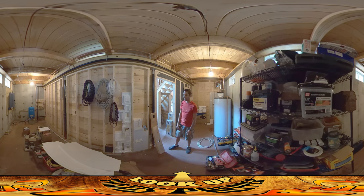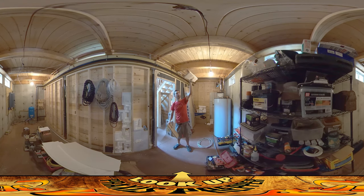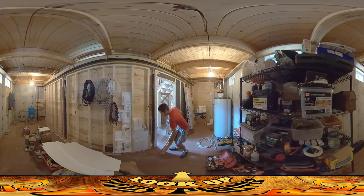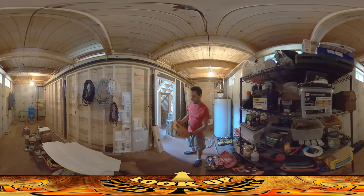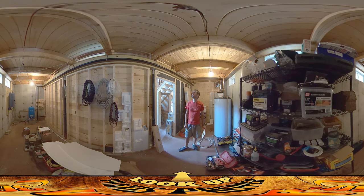I'm going to fill it up with all different bits of scrap, then buy one inch foam and fly it over the top, maybe put some thin quarter-inch plywood or luan over it to hold it all together and make it look nice. The thing I'm working on today are these little fake beams that go from floor joist to floor joist and will hold things like lights and smoke detectors. I'm using this little template to cut junction boxes into them — it's made for a metal electrical box with a couple of drill points. My dad was able to accomplish a lot of electrical work yesterday, which was great, and I finished up all the vents in all the bathrooms — the outside expelling hot humid air vents — so those are all done.